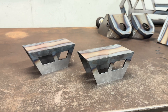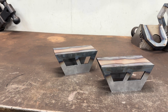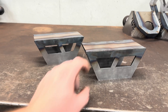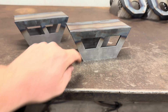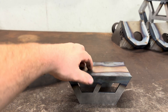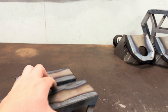And then the rear set. Like I said, these ones are shaped this way because I can't have the piece that wraps around the side of the frame — it's right where the rear leaf spring hanger is. Same thing again: I made these windows smaller on these kits so you have plenty of meat here to trim it down to make it fit your build. Again, no hole on top, so just get these set up on your frame, get your bed where you need it, and drill straight through your bed into this plate and then you can bolt it down. That covers the whole kit.